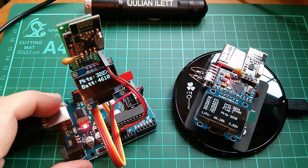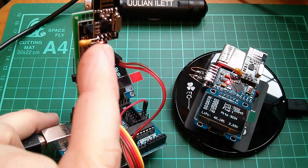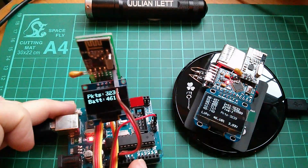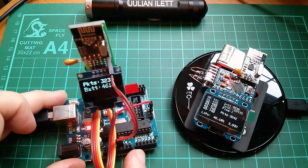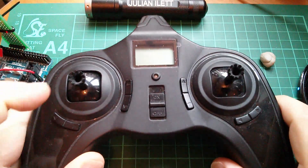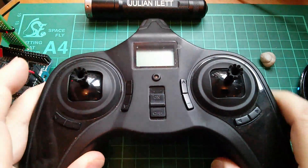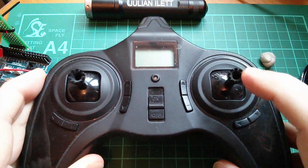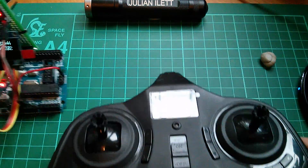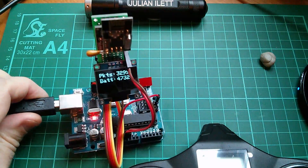The radio control transmitter is going to be something like this — with an Arduino, possibly an OLED, certainly an NRF transceiver, and potentiometers on the analog inputs for the various quadcopter controls. Just like my Hubsan controller has throttle, rudder or yaw on one pot, and pitch and roll on two potentiometers, the transmitter will have potentiometers connected to these analog inputs to act as the radio control transmitter.